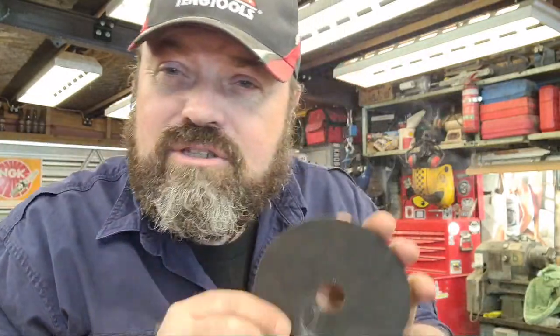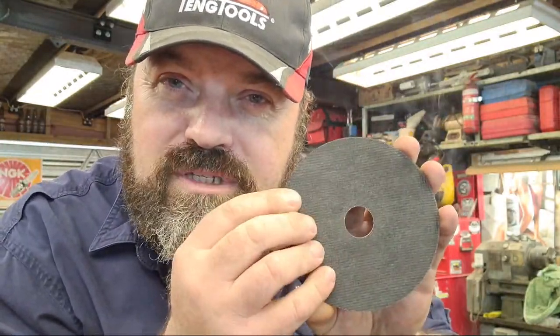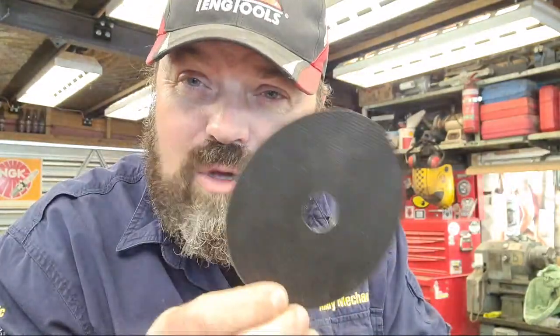Now you say, well, how can a cutting disc expire? Well, the reason is to do with the bonding agent used for the material, and over time, it breaks down. I don't know if you've ever had a cutting disc explode on you. I've had a few. And it's at that point you really wish you were wearing a full face mask and not just a pair of goggles, believe me. These things go off like a little bomb. They fire shards all over the place, and some of the shards can be pretty big. So there you go, date stamp.